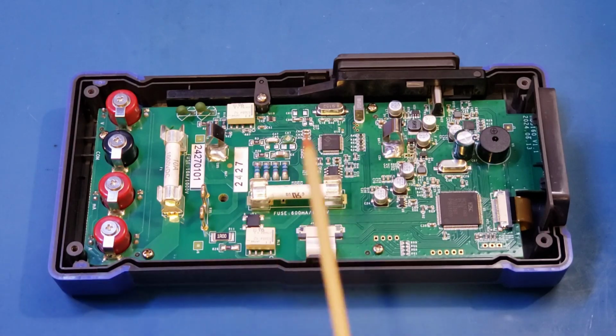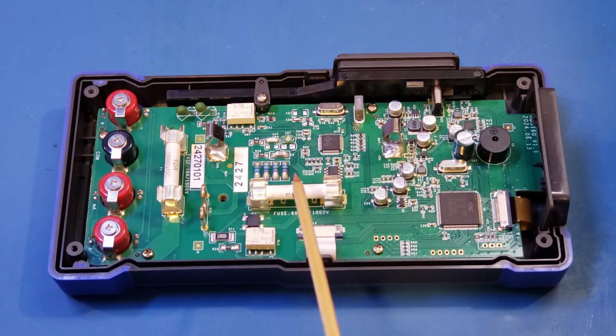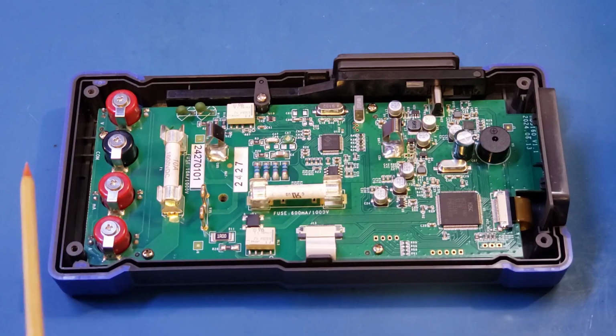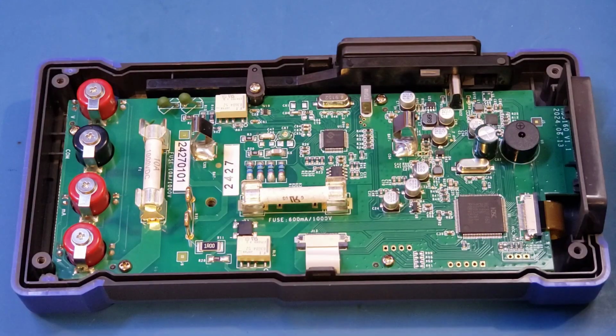And the DMM section design is also ever so slightly different. You can see that on this HDS160, we actually don't have the isolation cutouts around the fuses. I'm not sure why that's the case, but those cutouts are with the HDS120 design. Other than that, I think the overall board layout and the design here is quite solid. Overall, just like the HDS120, the HDS160 is pretty well designed and pretty well built.